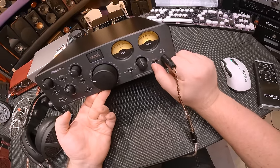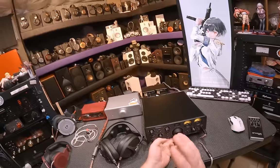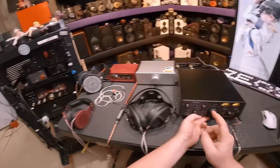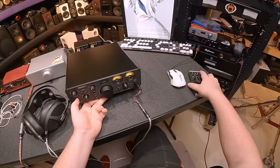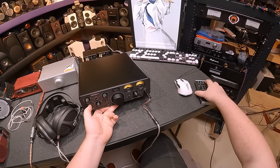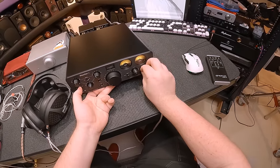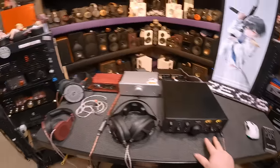This adjusts the calibration of that. Plus 12 means that your source is very loud and you need the gauge to be less responsive. And then it goes to plus 6 and then to 0. Now, the way I have that set up, I was actually running it in plus 6, but I think 0 might actually be better, especially on the RCA input. Why am I confused? I wish they were more controllable, but having that adjustment is fine.